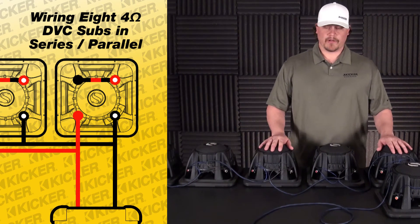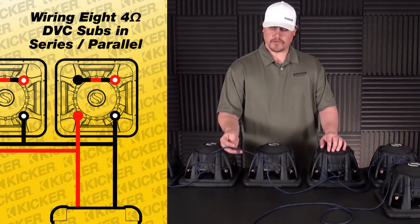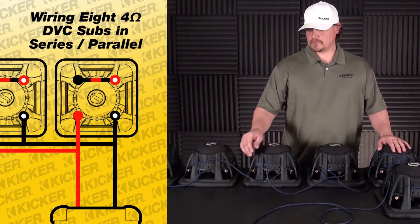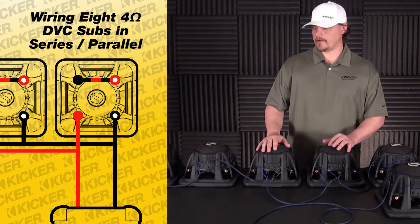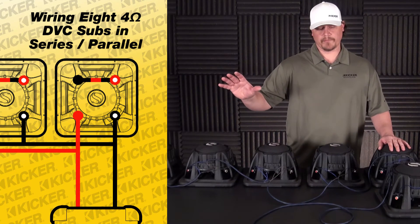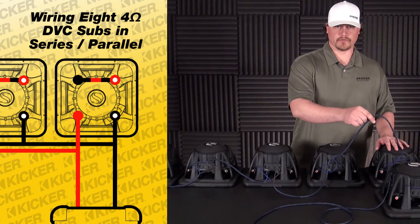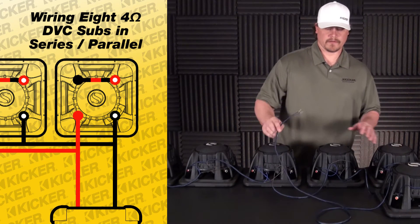If you sectioned them up in groups of fours or twos, or if you have dividers in your box, you just need to drill a hole big enough to run your wire through to jump to each woofer. You can silicone it shut if you want — you don't have to. If you have them paired off in groups of four in individual boxes, you can still run wire from one box over to your second box so that you only have one wire coming out for a cleaner look.